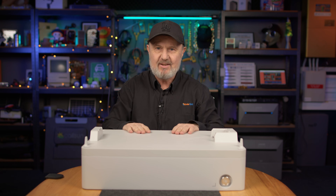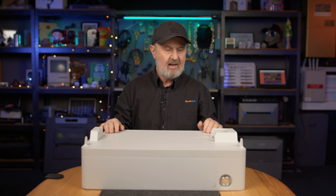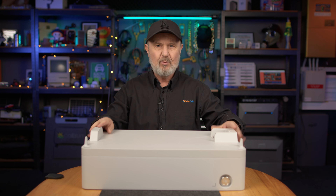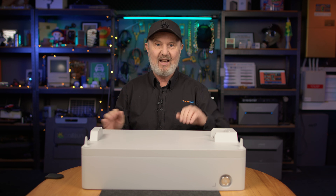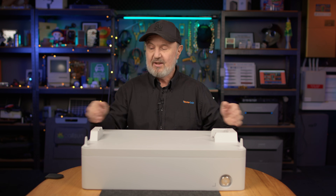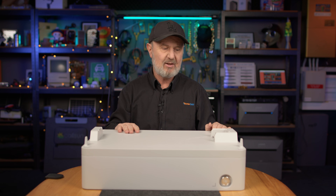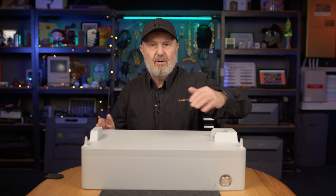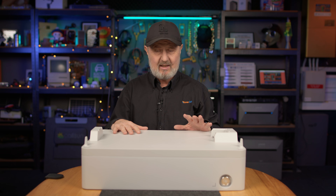Here it is — one of the stackable battery units of the EQ4800 series. One of the things I really liked about the design is the inbuilt handles which also are locating pins. When you're stacking these, there are no cables — there is just an integrated connector, which has some special features I'll talk more about. These integrated handles make it really easy for two people to lift. It's kind of heavy for one person so I definitely recommend two. It also has a pressure release valve on the side, which is a standard feature on lithium-ion batteries in case of a fault condition — they can release any excess pressure.